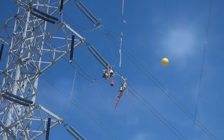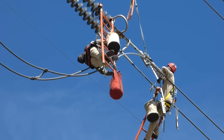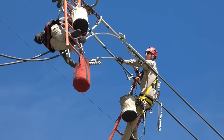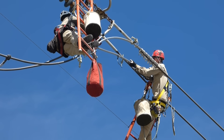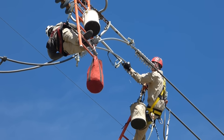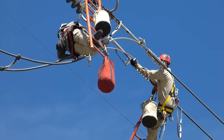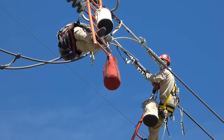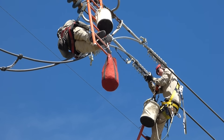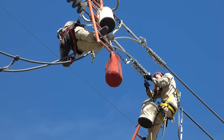The second Clampstar is delivered and the installation process is repeated. This particular Clampstar is a flexible version unit designed for dead ends and suspension clamps. All Clampstars are range-rated, and this unit is designed to handle conductors from 336.4 KCmil through 795 KCmil. The total offering of presently available Clampstars can handle conductors from number 6 AWG through 2750 KCmil, double ACSR, and 2550 ACSR.